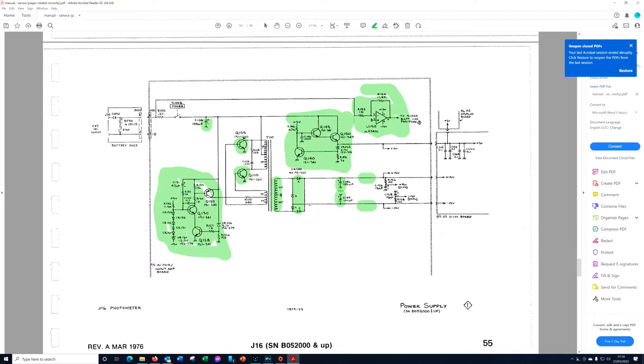I'm definitely going to take a look at these two transistors - and I noticed these are socketed, so that's going to make it very easy. There is an issue: sometimes you get a chain of problems in a power supply, so even if we find one fault there might be others. Let's have a look at these voltages now we don't have any loading. That's still low. The input is pulled down a long way - maybe it needs to be low. Let's look at a couple of other devices and actually remove these two components.